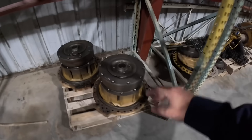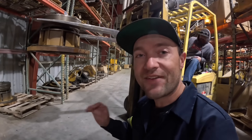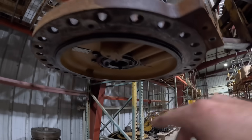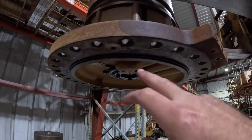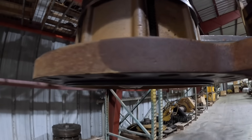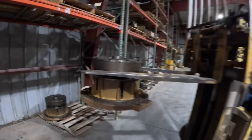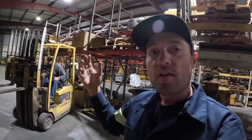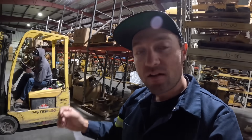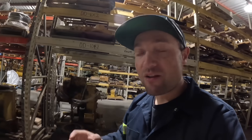Right here is a D10N steering clutch, part number 9U9082. Here is the underneath of a D10N steering clutch — this area is where the final drive would bolt on. You have these passages, and those passages are what change from the D10N to the D10T. On the D10N they stick down ever so slightly, almost level. What happens is when they updated that part to the D10T steering clutch, that passage sits lower. So what they had to do was mill the spindle down in order for the steering clutch to clear. And I have a perfect example of what happens when you don't mill down your spindle.